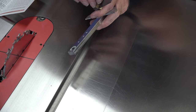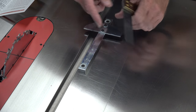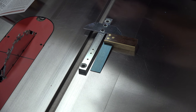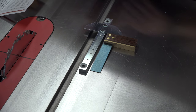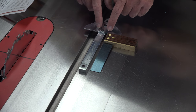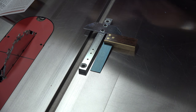As far as I'm concerned, this is not square — it's definitely got a bit of an angle to it, leaning to one side. In order to square that up, we loosen off these two black bolts and then square it up properly. Every imperfection from the beginning stages will carry through your project — if this plate isn't square, neither will the cuts be on your boxes. So take the time to get that plate perfectly square, then we can move on.